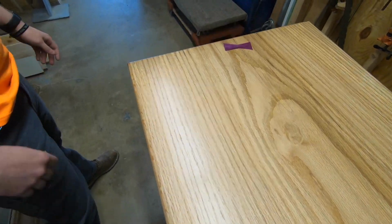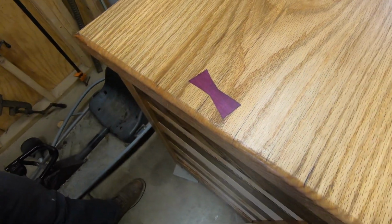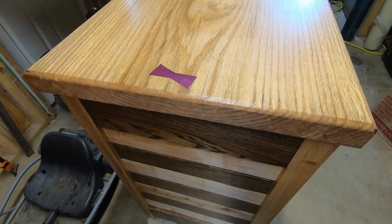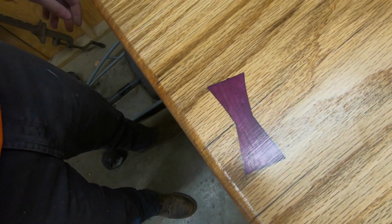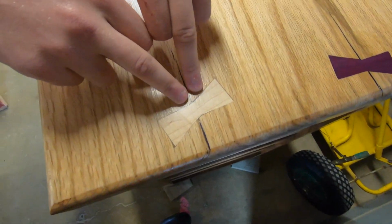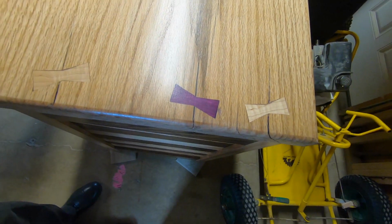So we have some beautiful slabs of oak that are right outside our shop, so I wanted to use one and put it in my project. Right here we have some custom dovetails, Purple Heart, thanks to Joseph Tati. Over on the other side, kind of a similar thing. It helps keep the crack from expanding. I see the crack there, so that's going to hold it together. Yeah, exactly. I did a kind of offset. I did two Purple Hearts, and two pieces of maple for that.